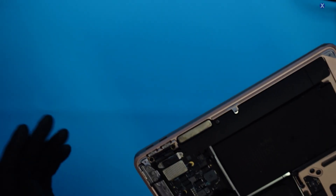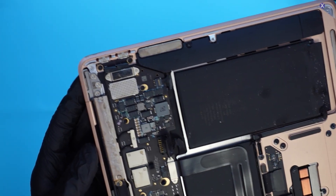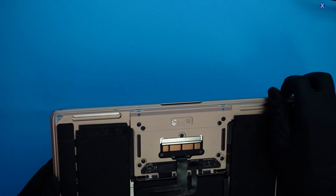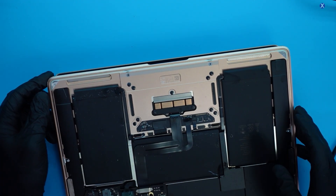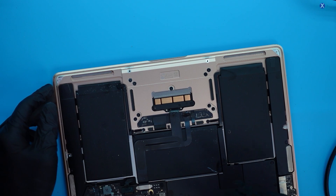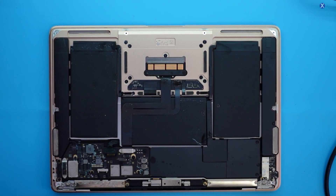It's super corroded there, but that doesn't necessarily mean it's all damaged. We'll probably have to put this in an ultrasonic because it's pretty bad just looking at it, but it depends on what it is — it's very sticky there. Let's go ahead and take up the board, go under the microscope, and take a look a little bit further. We'll look at some of the other areas to see if anything else really needs to get replaced.